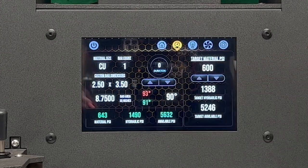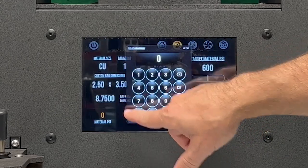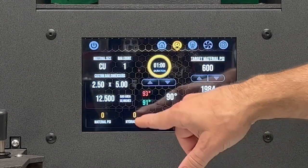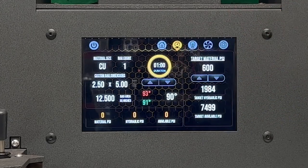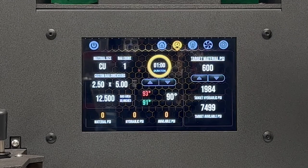Let me release the pressure. Next time it's going to be, say, five inches — so you hit this, change the surface area to five inches, and now you can program 250 or 300 material PSI, right where it starts to flow for you.